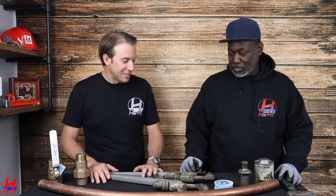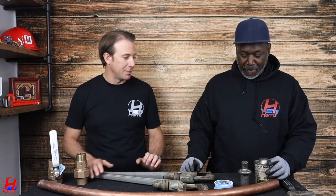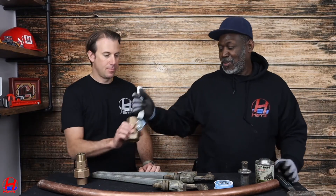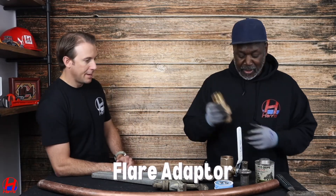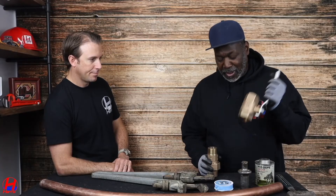So let's assume that if this is a live setting, the water main has been turned off and it's safe to remove the old valve and now we're going to install a new valve to the new K-grade copper water service. What type of supplies do we need? First we need a new valve — we'll use our Apollo ball valve — and you need the flare-by-male adapter. We're using inch-and-a-half copper, inch-and-a-half valve, and inch-and-a-half flare-by-male adapter.